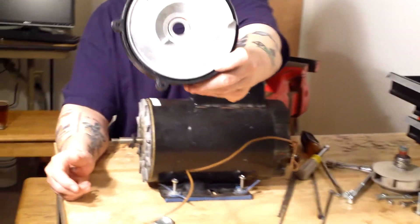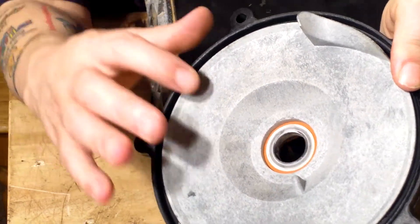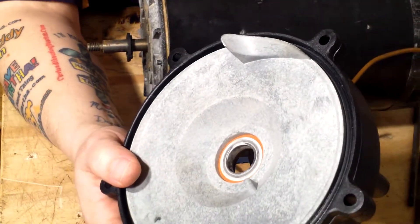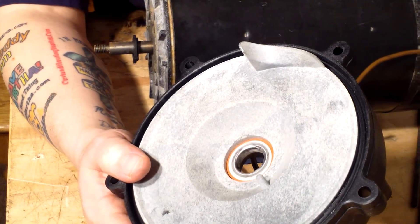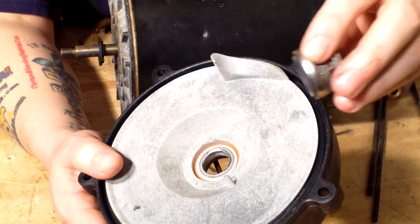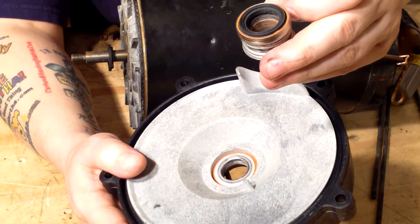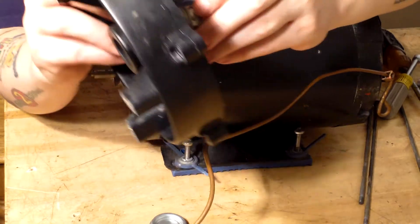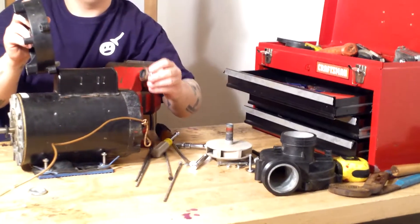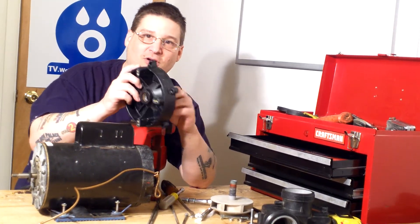I want you to see something on the seal housing. Robert, zoom in real close on that white part so you can see it clearly. See that black stuff on there? That black material is similar to when your toilet flapper goes bad. On this part of the seal, you'll see that black material — when it starts breaking down and wearing, after a while it becomes uneven, starts cracking, and the seal can no longer function.